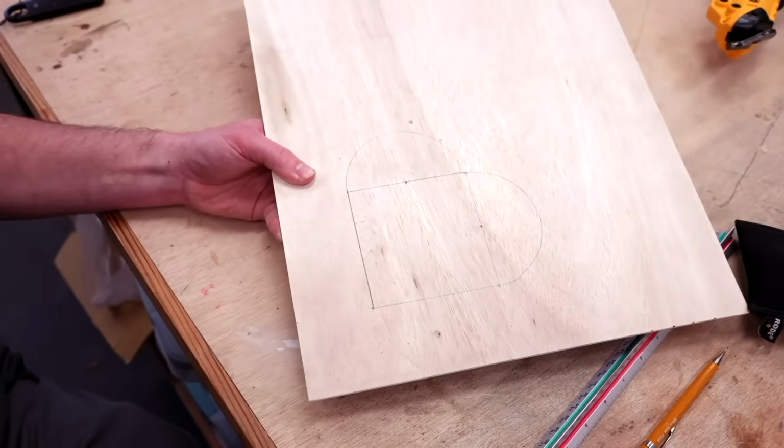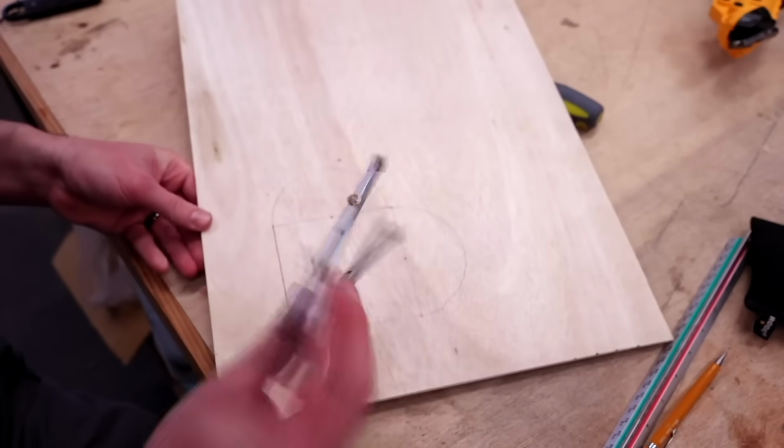That's just one of the reasons why a compass comes in super handy in any workshop. I would draw that out on a piece of cardboard, cut it out, and use that as a template. The thickness in the description of this is 1 inch total, so that means that every bit of this material used is a 1/2 inch thick. So super easy to make.